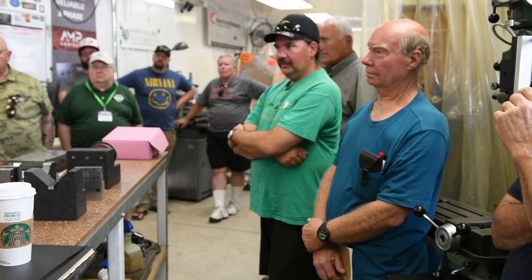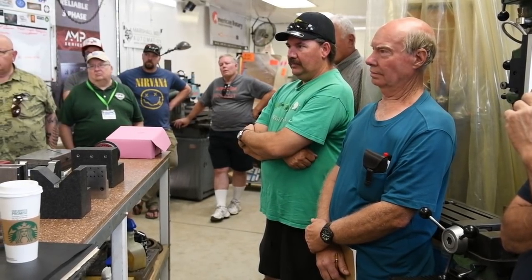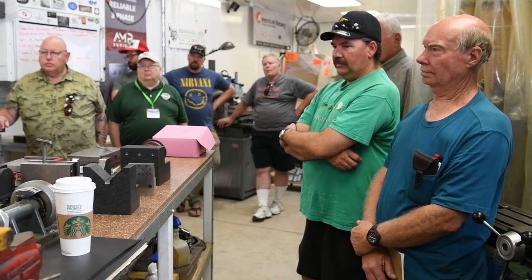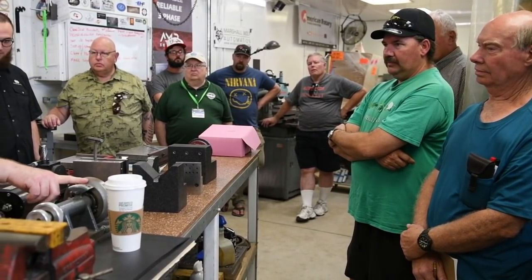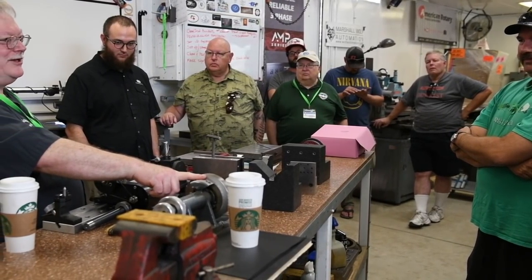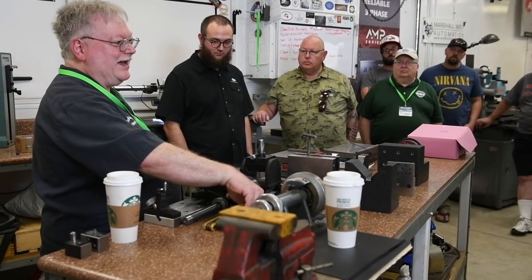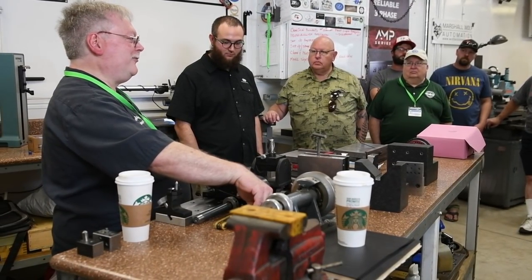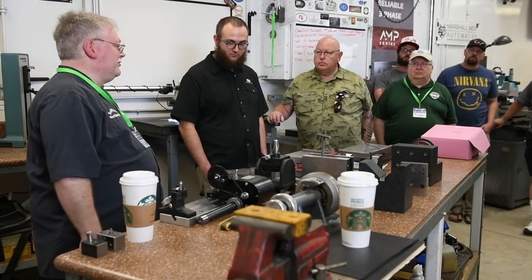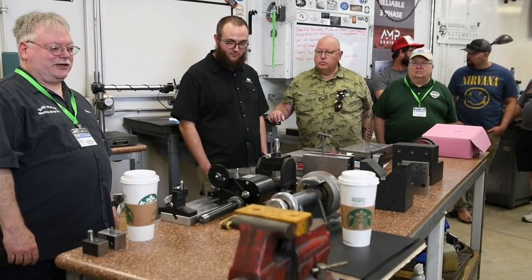You dress that wheel and the key is to try to get as many of those steps in there as you can. If you have a radius and an angle, you put both on there, cut that shape in the wheel. Then you've got another angle and another radius to blend - you change the setup, get the new radius and angle, and always have it overlapping. You're coming in waiting until you're fairly touching that edge. So there's a lot of loops involved. It's a really nice tool for a precision angle, a precision radius, and blending them in.